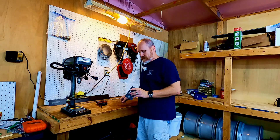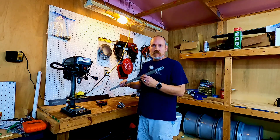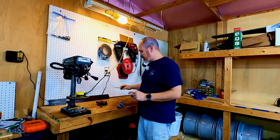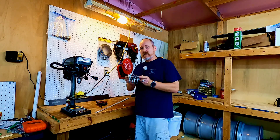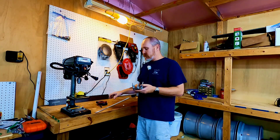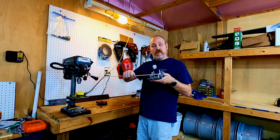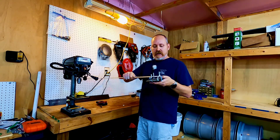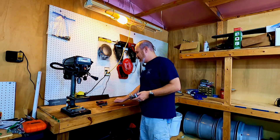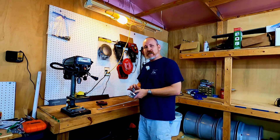So I've come up with a plan B. I'm going to use another piece of one-inch flat steel - I'm going to cut a five-inch piece to match the length of this. I'm going to isolate both of these, and on the shield side I'm going to make a bar to connect the shield to the other side. It adds one more level of complexity to my design but I don't think it's going to be that big of a deal.